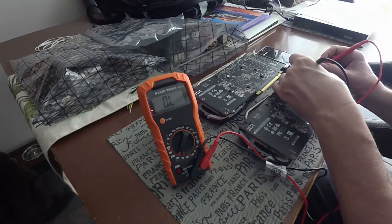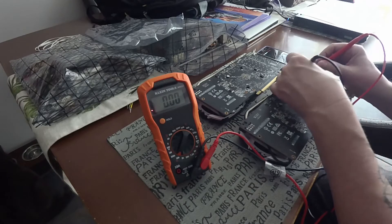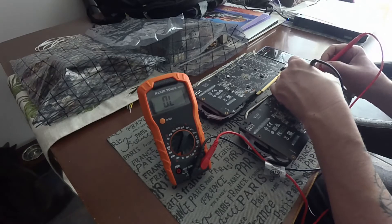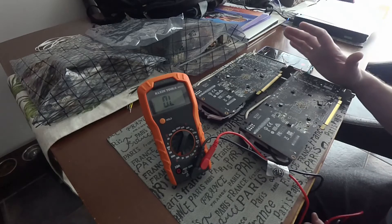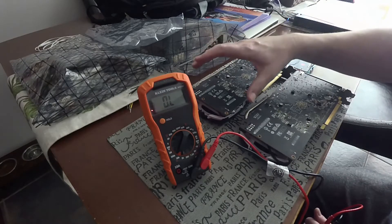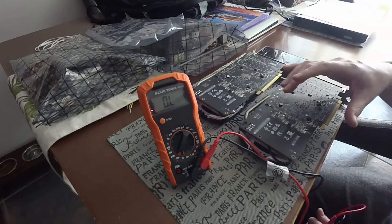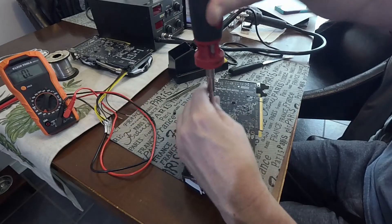It's supposed to charge up like that on a good card. Now on the bad one, you can see it's completely zero again. This whole bank of capacitors, or whatever output they're attached to, is completely shorted on this card. My goal now — whether I'm going to succeed or not I don't know — is to use the good card to help isolate what has failed on the broken one.